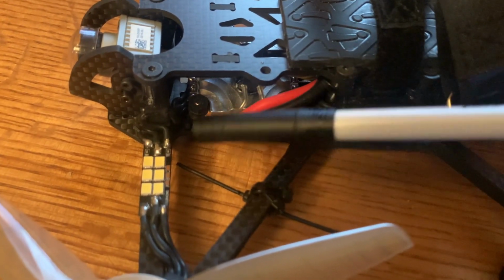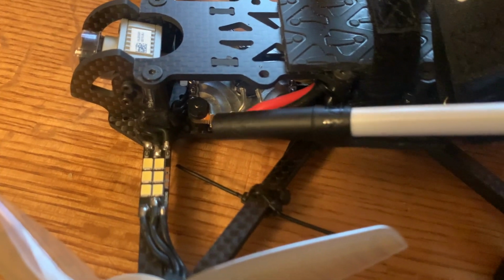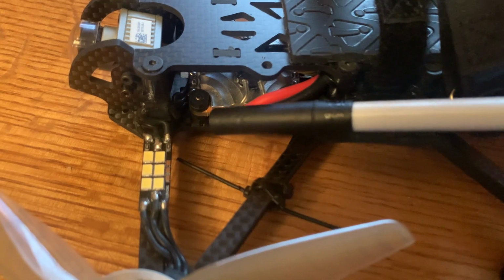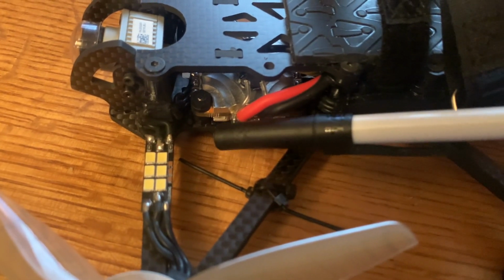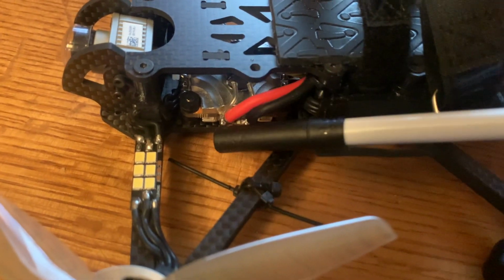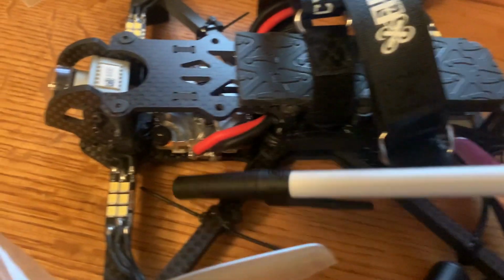I think this flight controller is worth it, but the pain point, as far as the cost, has really gone up significantly. And the other con I have with this one, but it's not a big one for me, is that it only has 3 UARTs. So typically F7s have more UARTs, but for this type of build, that's plenty.